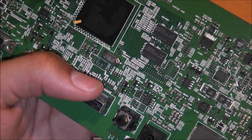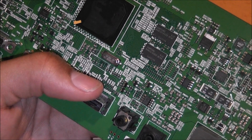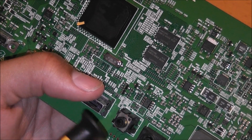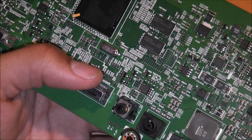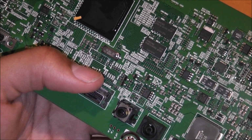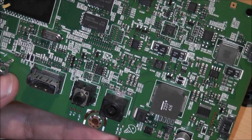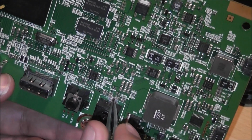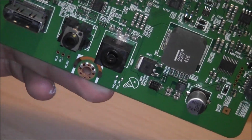And I would be able to then have the earth of all of those back. Then I would be able to wire the earth directly to this board, which would then be able to handle the 19 volts from the Shield, the 14 volts from the monitor itself. We can do that. Okay, so I believe I have separated the two rails, so that will be now our 240 in, and this side will be our 14 volt in.